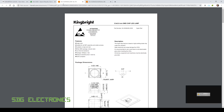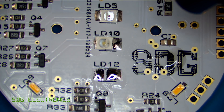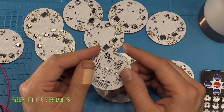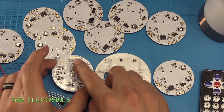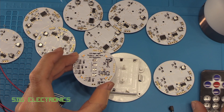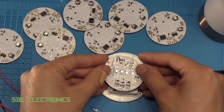It's not a big deal — I'll be able to swap these LEDs around. Now we've got the LEDs in the correct orientation, the next thing is to install the infrared receiver and also an LED. The infrared receivers are Toshiba 38 kilohertz infrared receivers that do all the demodulation for you, and that gets mounted into the three holes just here. There's also a newly added LED because on version one of these PCBs, you couldn't tell if the lamp had received the infrared signal. This time we've got an LED that lights up for 100 milliseconds every time it receives a valid code.